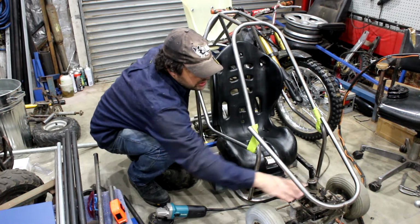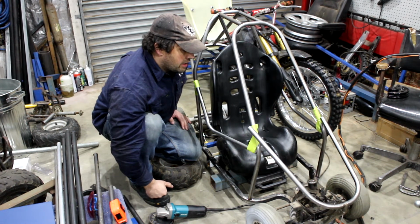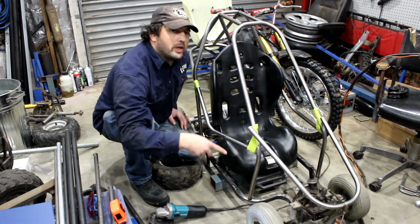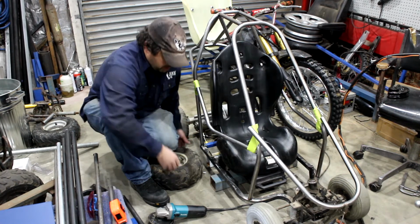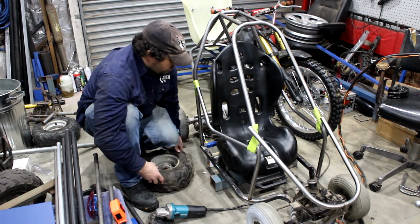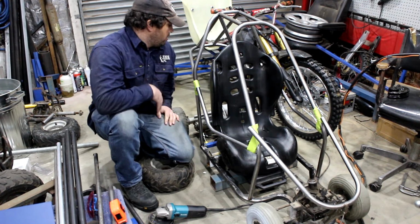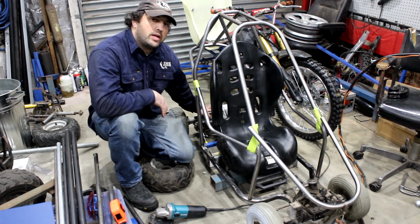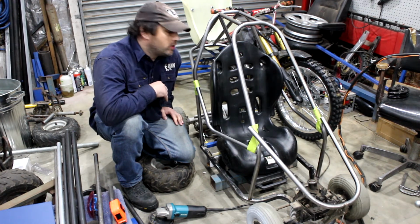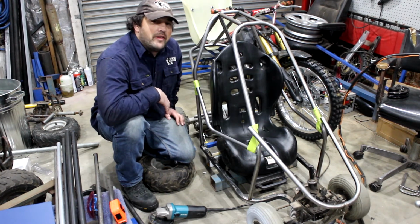Now, all this is, well, possibly just going to get all cut out all at once and have something slightly different in there. But these grey tyres, they are only going to be on it for the first test, because we're putting on these little fellas. Now they should work alright with the electric motor, so it'll be interesting. We've still got to build the swing arm to mount the motor, and then the battery racks in the back. We're just going to have 2 batteries to start with, running at 24 volts, and yeah, this is going to be a fairly awesome Power Wheels.